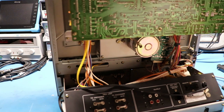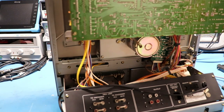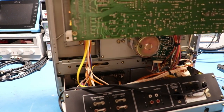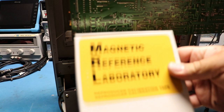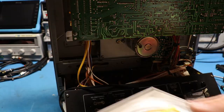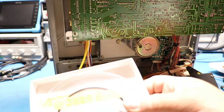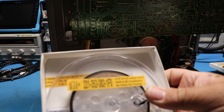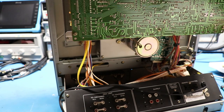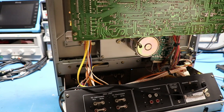There are other things you have to do, like checking that it's on speed. For that you need a scope and reference calibration tapes - one for each speed. This one is for seven and a half, and this one is for three and 75. The calibration tape tells you equalization and everything else. A lot of people get the duty cycles on the motor wrong, so I'll probably do a separate video on that, but at least this machine is working.